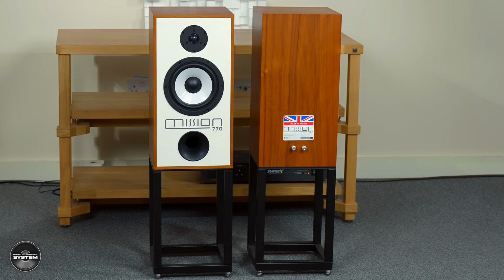So on the inside, we've also got the heavy flaring, but not just that. Because we've got a baffle area around here, this also affects the way that the air behaves when it comes from the port. So we've mimicked that on the inside. We've got another baffle on the inside of the cabinet for the flaring in there as well. So we've got equal reaction in and out, and you can't measure the distortion from that port. It's unbelievably low. And that allows us to achieve a clean response down to 30 hertz in room, which I think is quite astonishing for such a reasonably sized speaker.